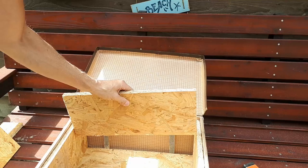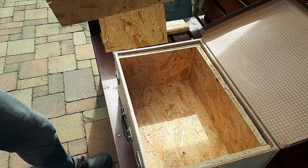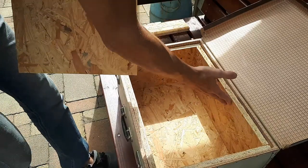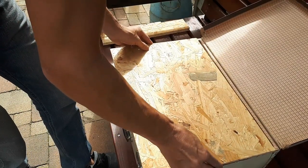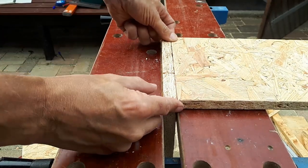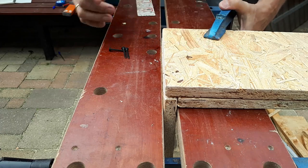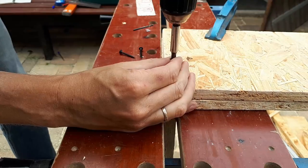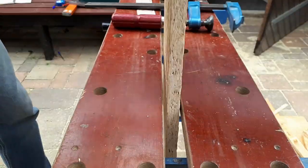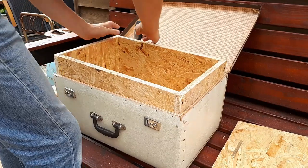Finally, I created the four side panels that make the cabinet into a solid box. I used a little trick to assemble all panels: I clamped one of them in my workmate with exactly one plate thickness above the surface. Using a scrap piece and the connecting piece, I could easily join the two pieces together at a 90 degree angle. I used pre-drilled holes to avoid splitting the wood. Then it was little work to assemble the bottom piece and slide the box into the suitcase. The cabinet was done.